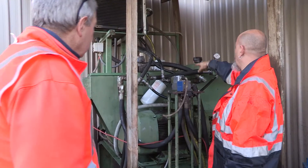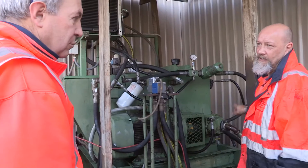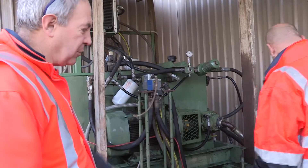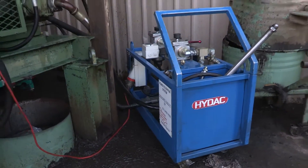The other thing we've done here is the other side of that — we're cleaning the oil using our unit, with a 5 micron and 10 micron filter. We can clean the oil down to approximately ISO 17/14/13 in about 2 hours. It's roughly about 300 litres of oil.